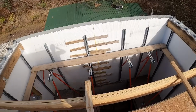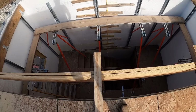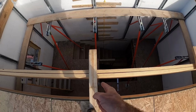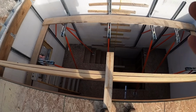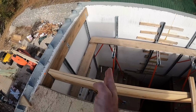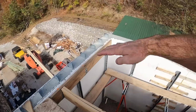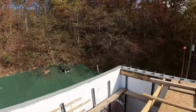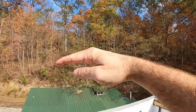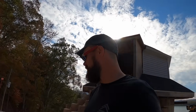And that's where I have the option of framing this out to wherever. We know for a fact the steps will not dump us out at this double joist. But I'm pretty confident it's going to dump us out about an inch off of this board. So I may be able to just turn 90, frame over top of this double joist, and come over here, and then frame it closed so that we have an access to this top, and then just have a shorter roof on this side, and this wall could get, again, that's going to be pitched from the top to the outside edge. So that would only have to come up so far, and then we could attach our rafters to that as well and then close it off. So got some interesting things going on over here in this corner.